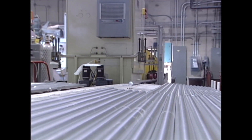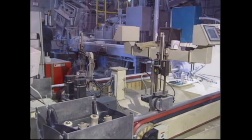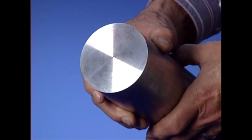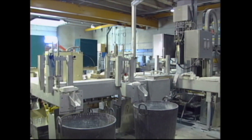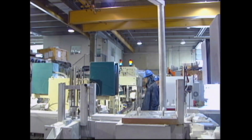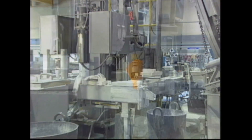To be able to produce a product on time, to the right size, to the right chemistry, ready to forge just at the point you need it, differentiates the FlexStream process from everything else. The heated trough system maintains the temperature of the molten metal constant and accommodates the low flow rates typical of small diameter casting.